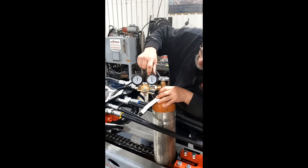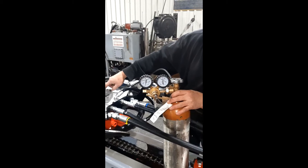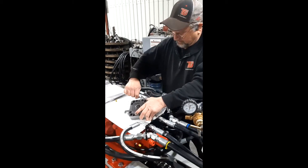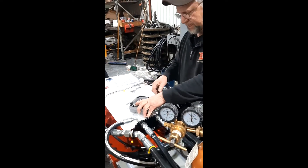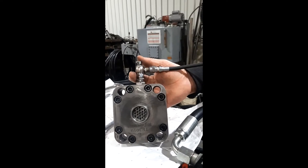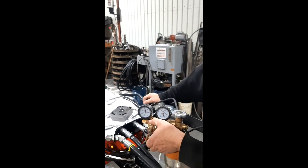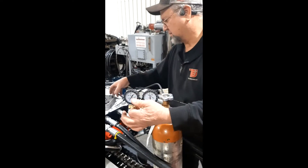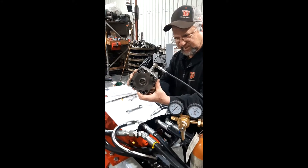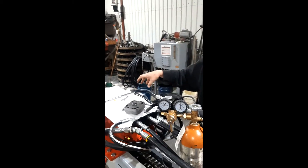We're going to look at our pressure gauge to see that we've got over 800–900 PSI. If you don't have 900 PSI in this gauge, you can't get as much as you need into the accumulator. We've got everything hooked up, our adapter tightened, and our seat opened up. If you look down in the side of that screen, you can see where the diaphragm is down inside there. When you start putting nitrogen pressure to it, you're going to see that thing come up. We've got a little over 100 PSI in there now, and you can see where that steel disc is up against the screen — now we know we're actually getting nitrogen into this thing.